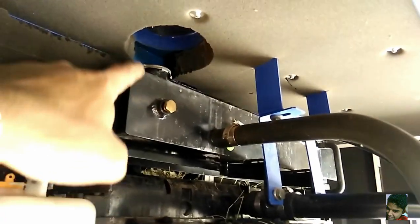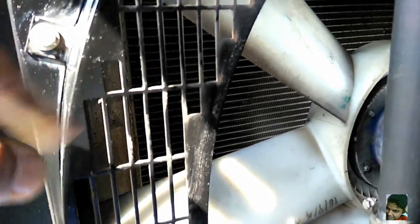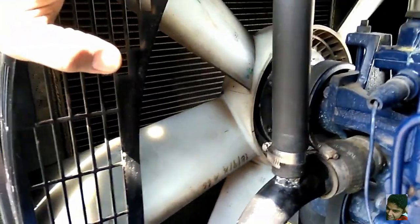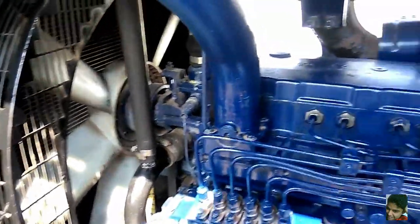This is the radiator and fan. It has coolant with a minimum-maximum level indicator and a filling cap. The radiator cools the air — you can see wavy fins, with water passing through tubes and air passing through the fins to cool it. Over time dust accumulates in there and obstructs normal air passage. To clear it, use a can of compressed air, spray through, and that helps restore cooling efficiency.